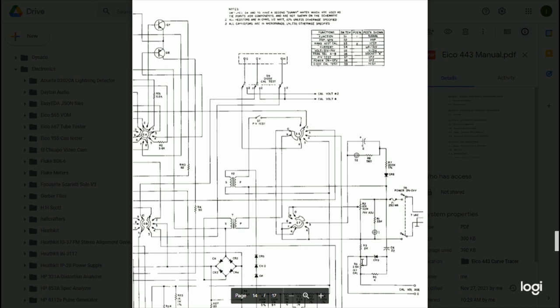What I'll do is just check out some resistance values in the transformer leads themselves. One side's got to be the primary, so it'll be tied to the 117 line, and then I'll just have to follow things through. I'm going to switch back to the view of the device itself while I'm doing that, just so you can see what's going on while I'm looking at the schematic.